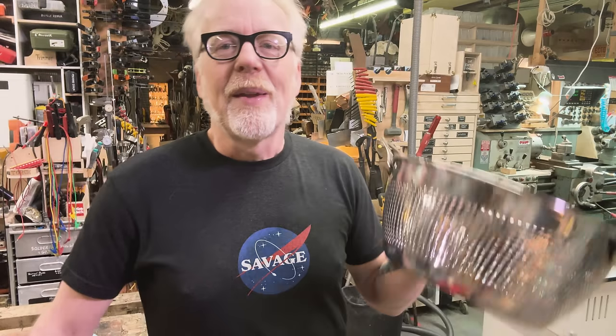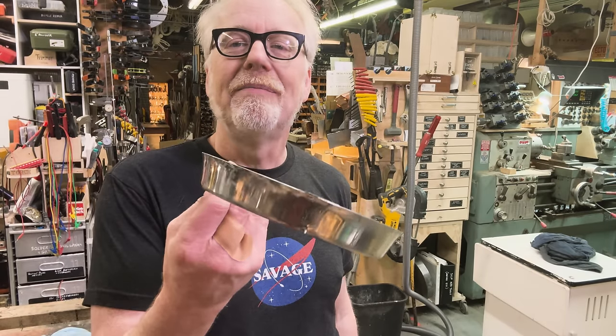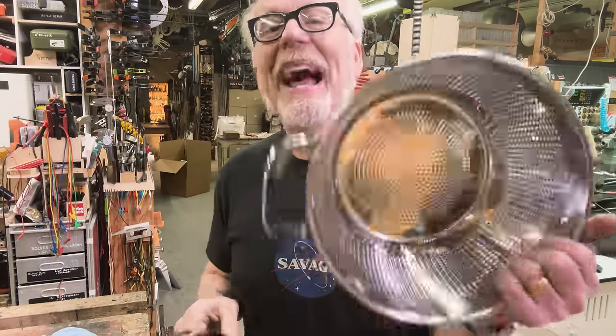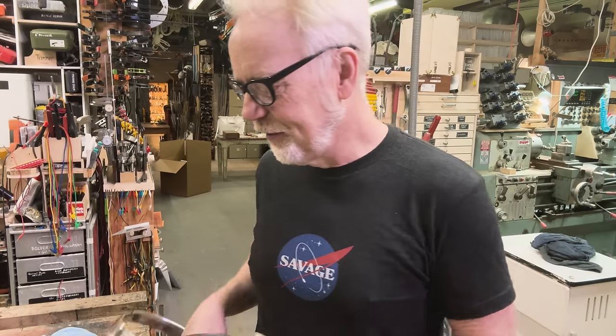That weld has failed. Yeah, I set myself up for a tough tongue twister there. It's fallen off, and I am going to put it back on. I'm going to modify this slightly and add 4 copper rivets to this. Not steel because it would rust, not aluminum because I don't want them eating food in aluminum. Copper should be fine.